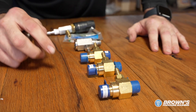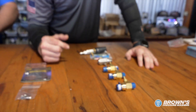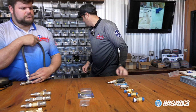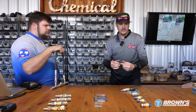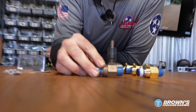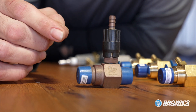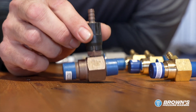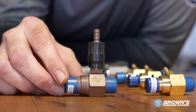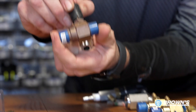These are all going to be 20 injectors — they do make a 10 but I don't have one for the picture; it's going to look identical to what you're seeing here. They also have adjustable injectors. All of these injectors are based on flow, so you always want to be mindful of gallons per minute and not your PSI. They are based off gallons per minute, so that's how you'll choose the proper injector for you.